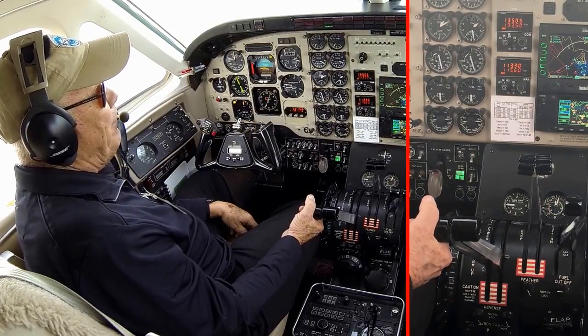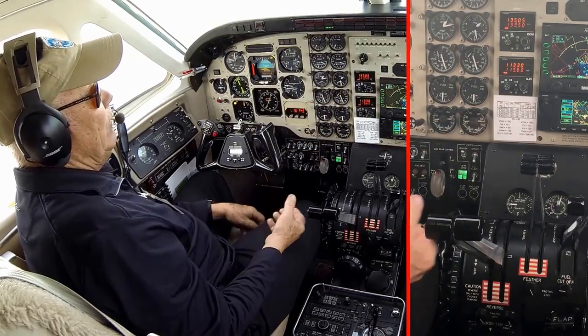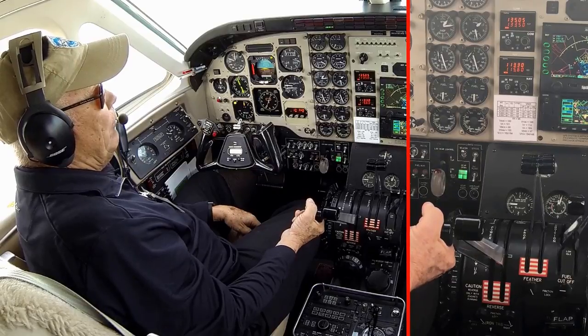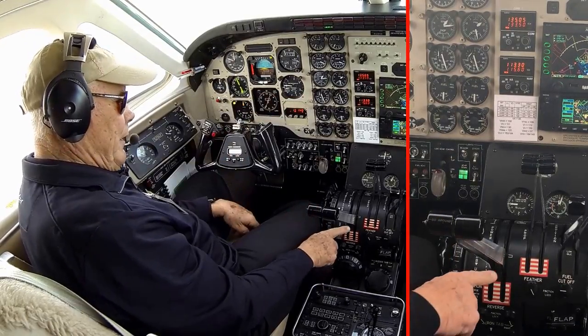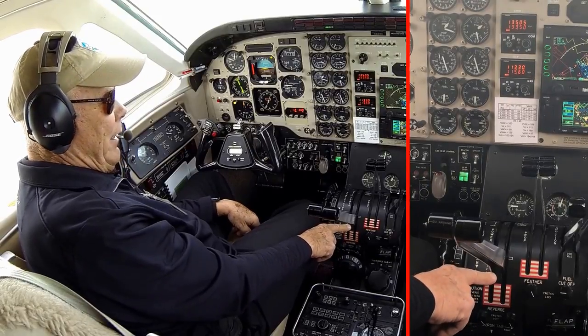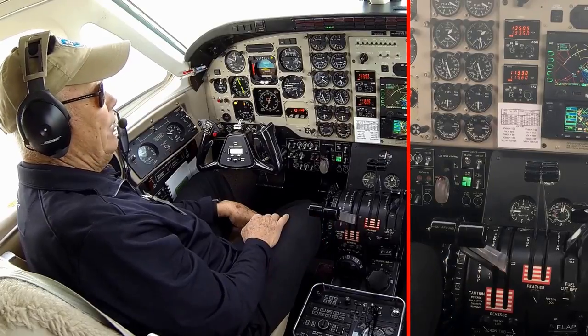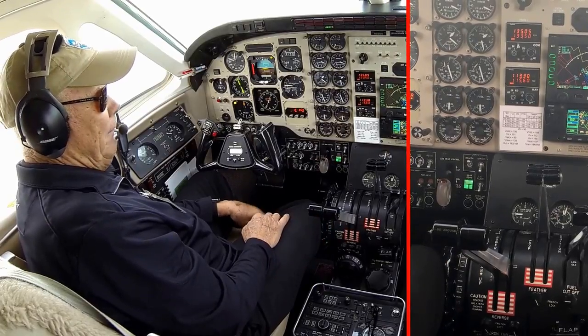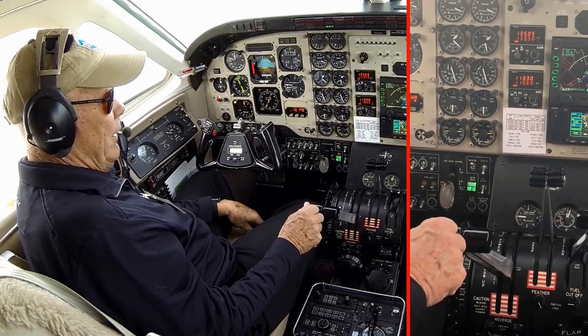We're leaving that dead band, the dead band where I can move the power lever and nothing happens to the engine. That's why it's called a dead band. But right there is when I leave it and start going up. Now my back end of that power lever is between the F and the T. Well, that's real close together. That's a nicely rigged setup. If it's within a half an inch or so, I'm quite happy with that normally.